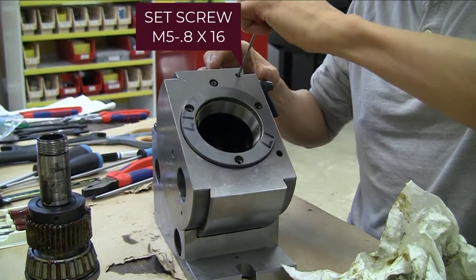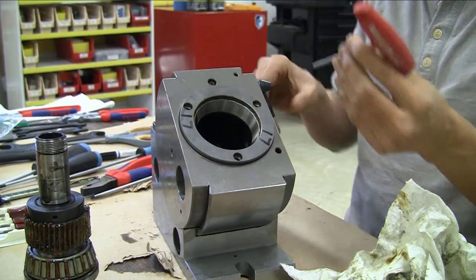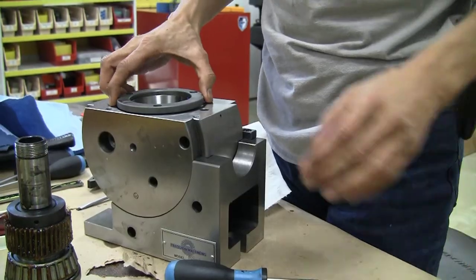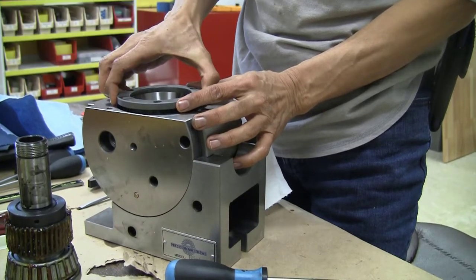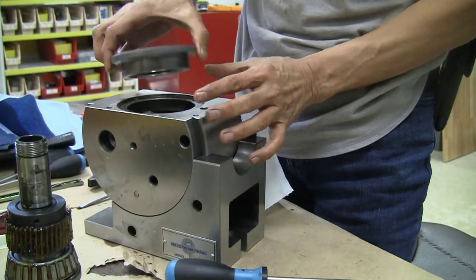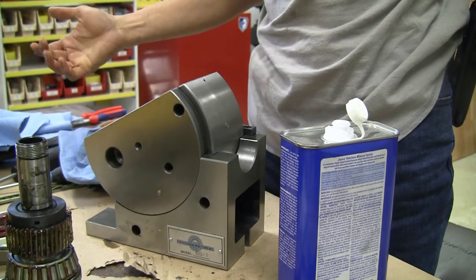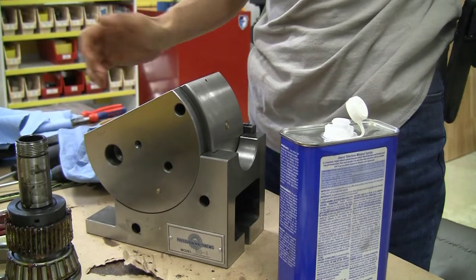Next I am going to remove the pinion that drives the locking pin for the quick indexing plate. The pinion basically had no grease on it, but it does not rotate fast. Then I am going to remove the front bearing seat — it is a very nice, snug, tight fit, but with a gentle rocking action it pulls out very smoothly. The back of the hub looks very nice and clean: smooth, no sharp edges at all. And the head itself rolls very easily with virtually no resistance — very smooth movement.